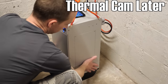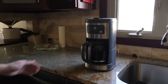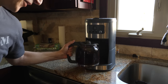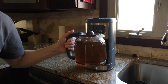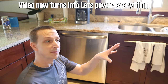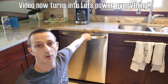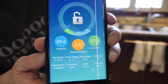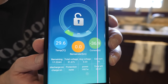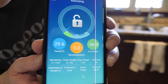I'm touching the entire battery — nothing is warm, battery cables are not warm. Full pot of coffee done. The wife got home and turned on a bunch more lights and the dishwasher. Current draw is 37 amps, battery voltage is 51.7, about 1900 watts — still running strong.